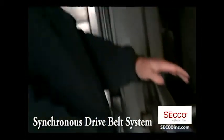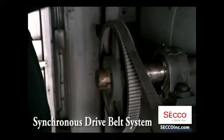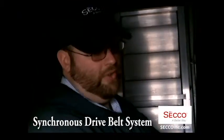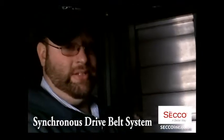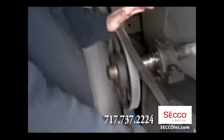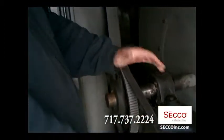This increases your belt efficiency from around 90% up to 98% or higher, and can increase your overall blower efficiency by more than 10%, depending on the state of your existing belts. The more worn your belts and sheaves are, the less efficient they are. I have personally switched systems from a V-belt to a synchronous drive and got nearly a 20% increase in efficiency. Very cost-effective over the long run because of how long these belts last. We put this on about six months ago and won't have to touch this belt again for nearly five years or more, depending on usage.